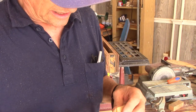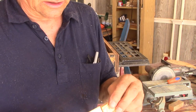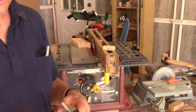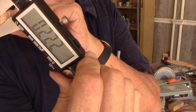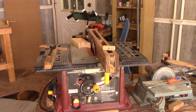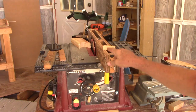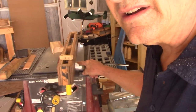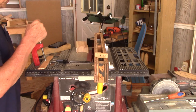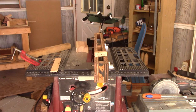Let's give it a try. I'll test it in the block first — it's a little bigger than 0.193". The calipers say 0.221"–0.222", so that's about 28 thousandths too big. I have to turn the little dial screws in to bring it in — in this case about 26 thousandths.